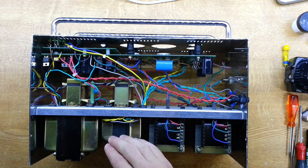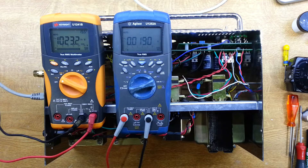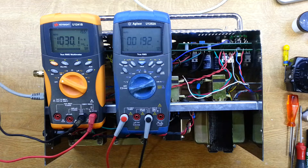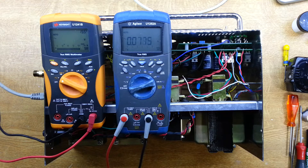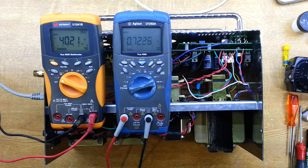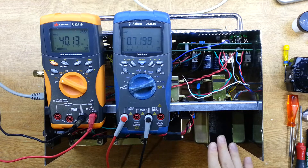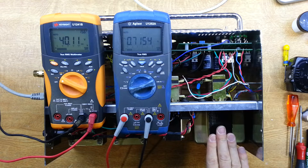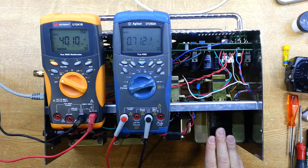There are some other secondary windings — but I think these are just heater windings for the valves, with no circuitry involved; they go directly to the valves. So I don't see the need to disconnect these. With the secondaries disconnected, turning up the voltage again — we're still pulling current. At our 40-volt reference we're drawing 700 milliamps. We should be drawing just a few tens of milliamps to magnetise the transformer. Obviously something's wrong — very suspicious that a secondary winding has gone short.